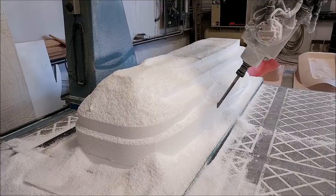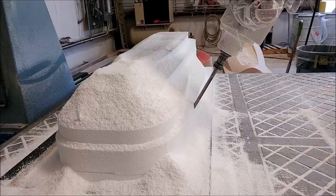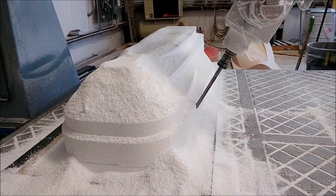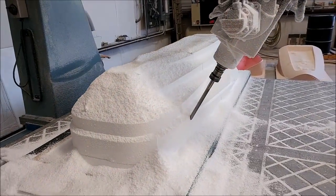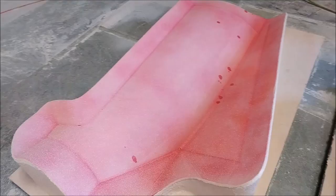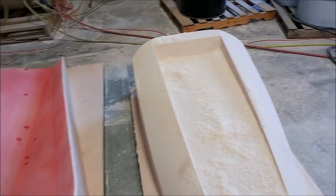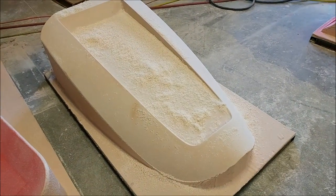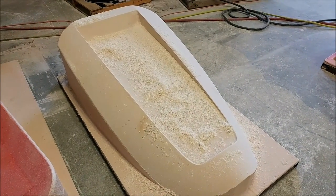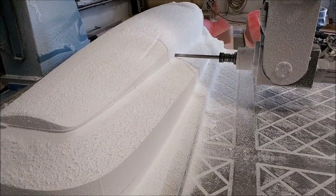Last time one of the things I showed you was the air scoop intake getting ready — I was working on the CAD for that. This is the foam being rough milled for that one. Here is the right side cowling plug, now off the mill and sprayed with some guide coat. And there's the air intake tray, finished and just needing to be prepped for sanding.